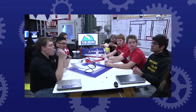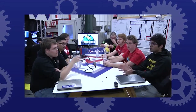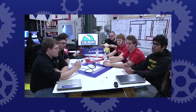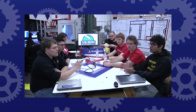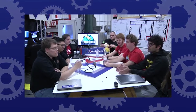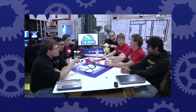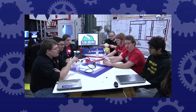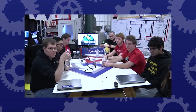From a controls engineering perspective: when planning your mechanisms, think about how you're going to control them. We've set up the arm system so that it has encoders built into the motors — that's planned out already. Don't just put together a lift or whatever mechanism and then add your sensor as an afterthought, because it is going to bite you. Make sure you have enough power to do what you want, and give it a little headroom, because feedback control requires that. Make sure you get your sensors designed in. The most important thing to remember is that every idea, within reason, that you come up with in brainstorming will see competition at some level — it is far more dependent on implementation than the actual base idea.